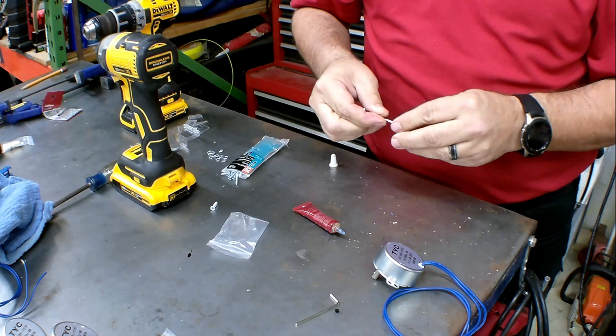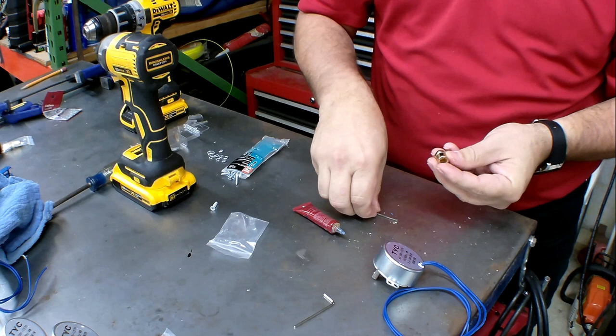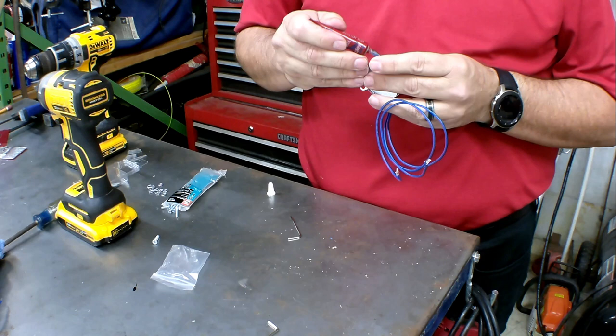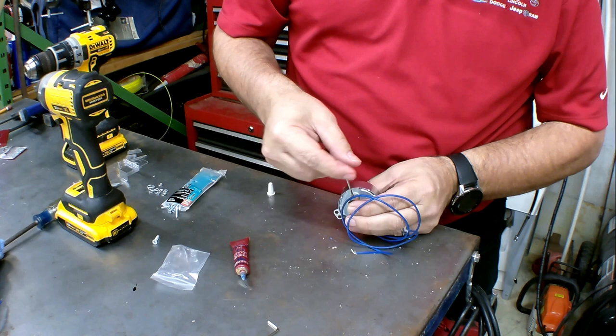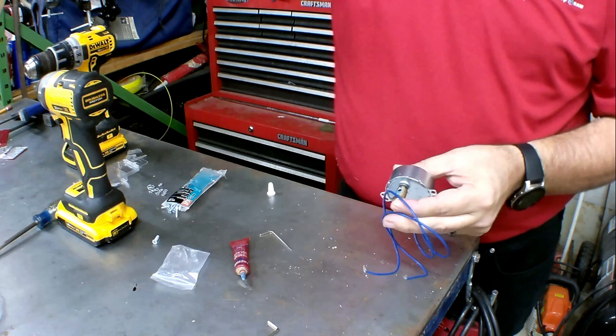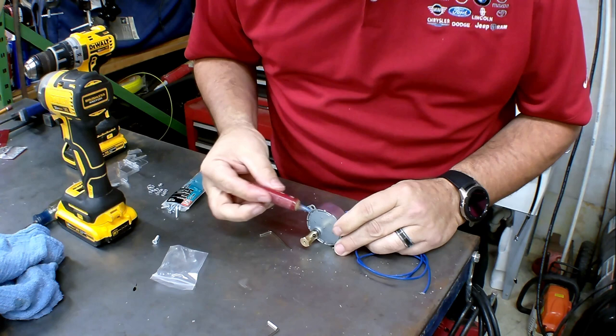So this part here is pretty much a repeat of the previous clip. It's just another night. He built numerous turners for me for an event that I was having. So I just wanted to demonstrate how he put it together with Loctite. He used just a little bit of Loctite because the way that this motor is going to be put into the base of the turner, it's not going to really be able to be removed easily to tighten the screws if necessary. So he wanted to use some Loctite to make sure that the screws were very secured in there and that they wouldn't ever try to back out.